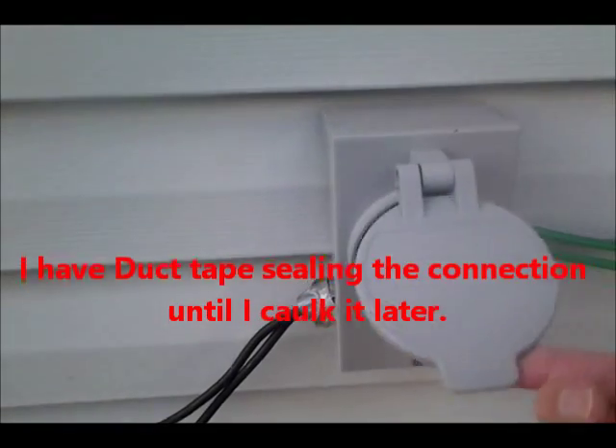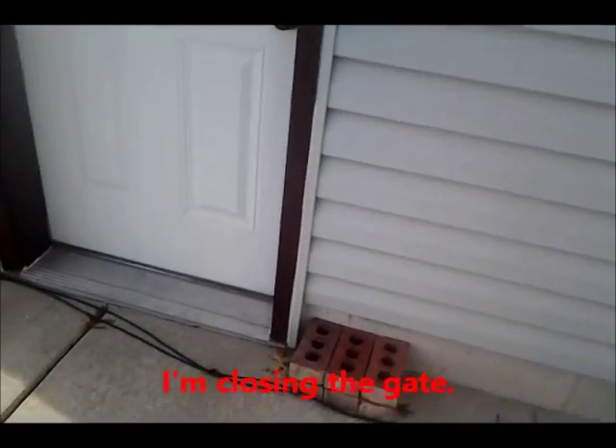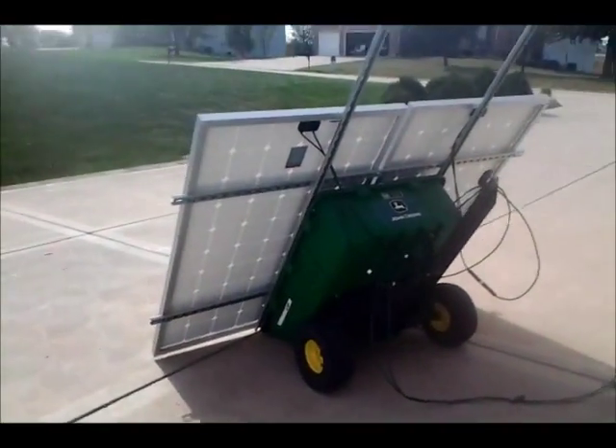The wires go into the side of my connection for my generator, which I hope to not use very often now. The ground wires that I showed you on the inside come out and go down and connect to the common grounding rod for the house panel. These are number 8 wires here and they tie into number 10 wires to go to the solar panels — another temporary connection between number 8 and number 10 wires coming from the solar panels.